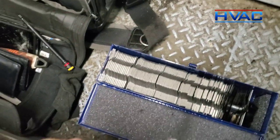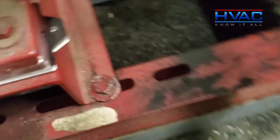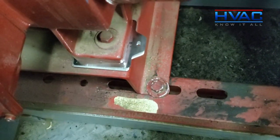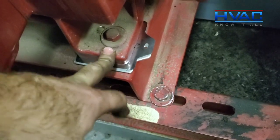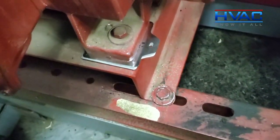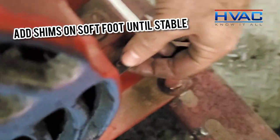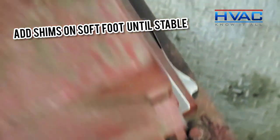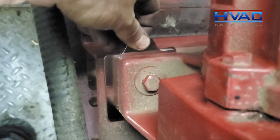Just so you guys know, here's the shim kit I'm using. In this kit there are actually 13 different sizes, 20 of each, and this is what I'm using to shim this. As you can see, I've got the shims in place here and on the front. Now that we're done with the shims, we've got to check for soft foot. Soft foot is if one of the feet of the motor is not sitting true and it wobbles. The way you check is just by tugging your shims — if they're not loose, that means the feet are sitting true on the base and we don't have any issues with soft foot. So we're good there.